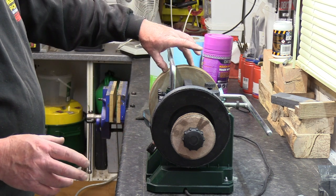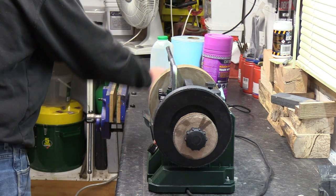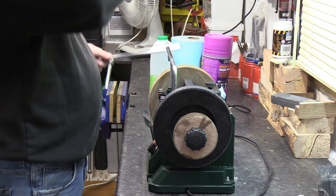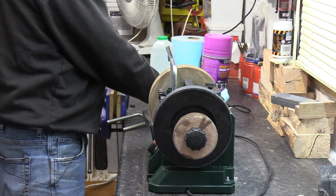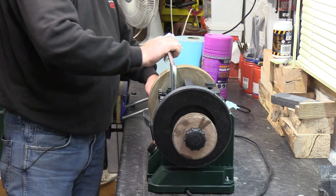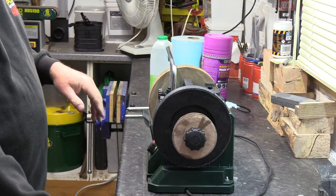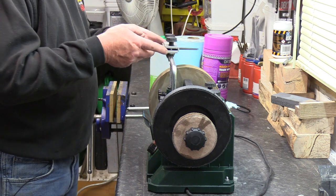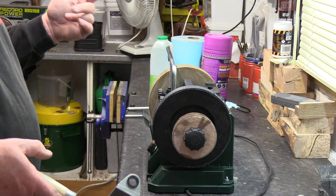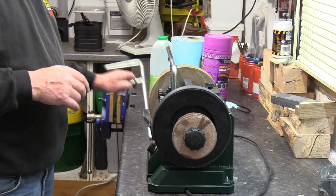Following on now, I've got to dress the wheel. I've cleaned my shafts and I've just placed all shafts that carry the jigs, and I'll just clean these with one of these fibre cloths, give them a good rub and then put on a little bit of wax on there. That's just so it all transfers over nice and smoothly because what I want it to do is glide across with your tooling on there. I want those to be nice and smooth, travelling across there with no grittiness to them. It might even be a case that you want to wash these bushes out again with something like WD40, give a clean out and clean the bushes out as well. Get rid of that gritty feel onto the shafts.